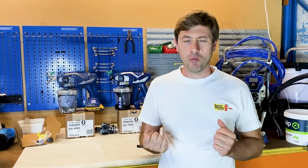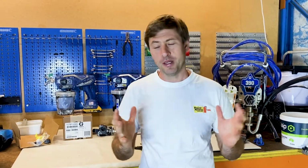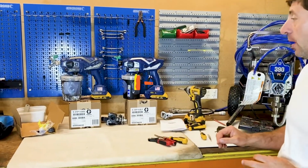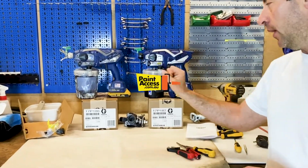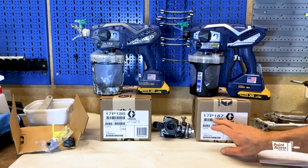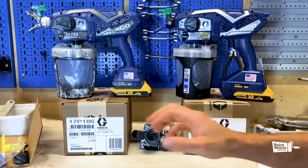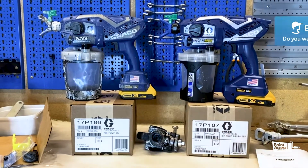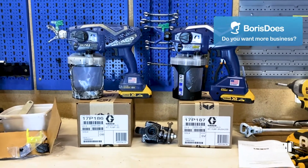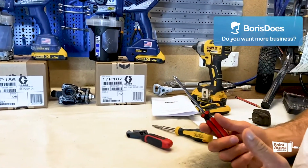Guys, we're trying to bring more value to your business, to your jobs, and save you a little bit of time and money. I'm going to talk about this video, how to replace the pump on Ultra and Ultra Max. Now, for the Ultra Max, the replacement pump is 17P187. For Ultra, it's 17P186. Now, we'll start disassembling. For Ultra, you just need the Phillips screwdriver and pretty much it for now.